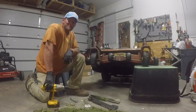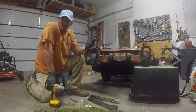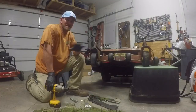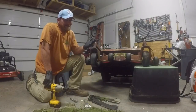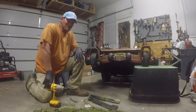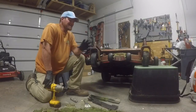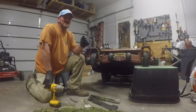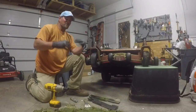This is especially true if you have to mow when your grass is a little damp — like early morning with dew on the ground. We don't recommend cutting then; you want your grass completely dry. But commercial guys can't always help it — we have to get the job done. When the grass is wet, it's going to stick to the bottom of the deck badly. So if we have to mow wet, when the guys come in that day they clean those decks immediately while the grass is still wet and easy to remove.